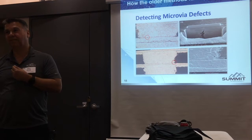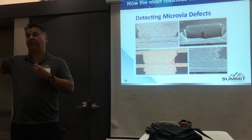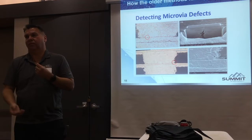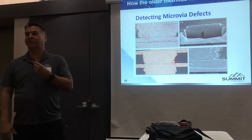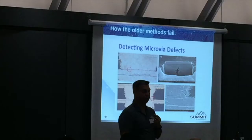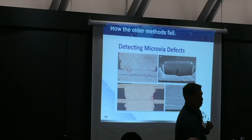Q: I can't understand how the aspect ratio on the hole makes a difference on that surface-mount microvia. A: I don't have the science — all I know is the aspect ratio. There is a mismatch between the solid copper and the glass epoxy expansion. Pretty much everybody is targeting 0.75 to 1 or less because they survive — just like with the 6-mil diameter rule. Aspect ratio 0.75 to 1 or less. Once you get to a 1:1 aspect ratio, I start seeing failures at reflow temperatures. The vehicle went open at reflow temperature and reconnected when it got back to room temperature. When you push to 1:1, you'll start seeing failures. When you get short and squatty, they'll pass.